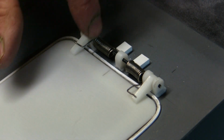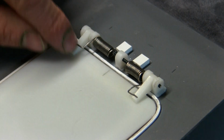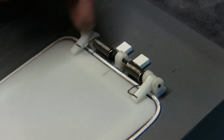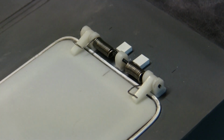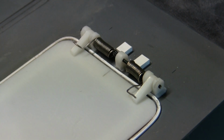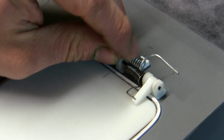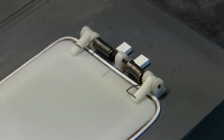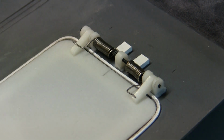So you can see how the spring has these dog-leg bends in it. This is so that, again, it puts constant pressure on the hinges over here so that when in the open position, it gives you the force required to make the hatch closing a bit easier. This is why I had to use the real springs on this, because when I use this spring over here, you would open it up, and then when you close it, the metal would stay in this position over here, which would hurt the look of the model. And this is why, again, I had to go with these springs.